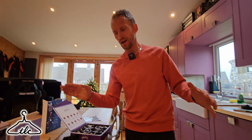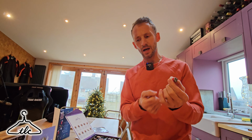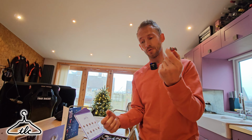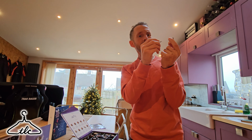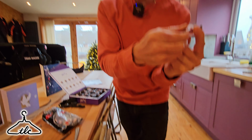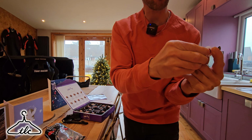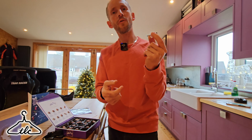And so once you have got that on the wall, like I said a minute ago, you poke that through, you turn it to open the wings. You've got the wings open. You simply put that through your bracket or whatever you're trying to fix, tighten it up, and then that will enter the inside of your bracket. And then it's got a nice rigid bit of plastic on the inside. It really, really does grip. Just don't over tighten, okay?